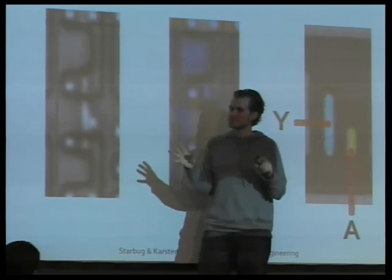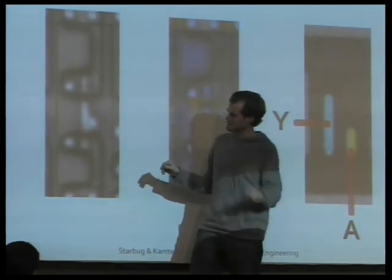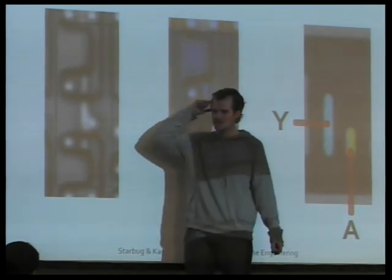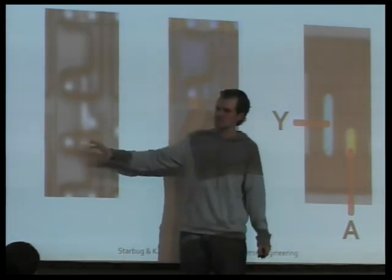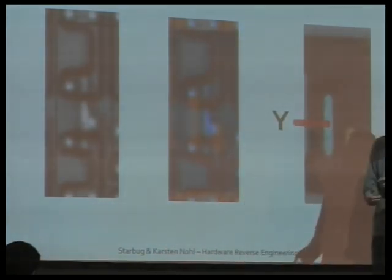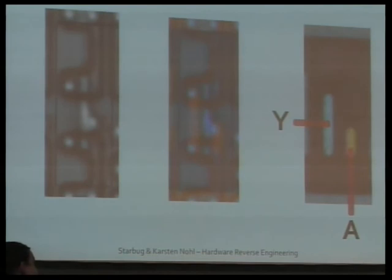Depending on the configuration, that's not always true. If you had, say, a 3-input NAND, then the NMOSes would actually be larger, but because you know it's a 3-input NAND, you expect that, and you can still tell which is which. Plus, they're always nicely separated, so P is always on top and N is always below.